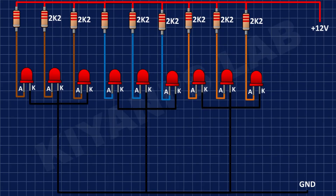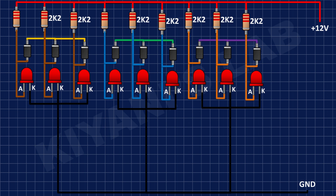After that, I'm going to connect the 1N4007 diodes — connecting the cathode of 3 diodes together in common, and their anodes to the positive pin of the LEDs.